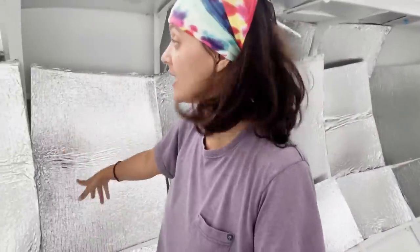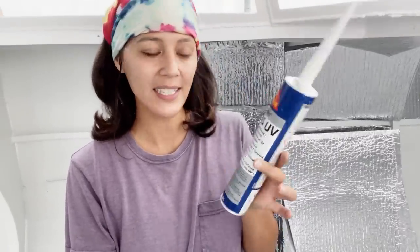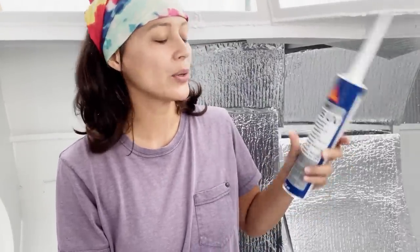So we're finishing up putting all of these insulation tiles back on the wall, on the hull, and we're getting ready to glue them into place. To do that, we're using Sikaflex because we can't use contact glue. We needed a resource that would let us snugly move the panels into position without destroying anything, and give us a little time before it dries.